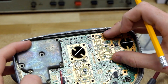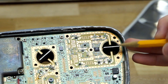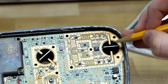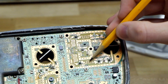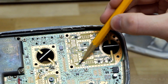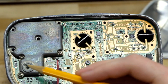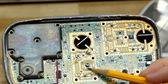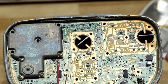This feed horn section and this one are symmetrical, so I'll show you this one for demonstration purposes. It's circularly polarized, so these two antennas — one is for the right hand and one is for the left hand — and there's a stair-step septum in the middle that splits the incoming wave. It's basically a series of low noise amplifiers, and then there are what I believe are called edge-coupled bandpass filters right here, and some more amplification. There's a dielectric resonant oscillator — actually two of them on this one — with a set screw to adjust it. That comes out of a BJT, which goes to a pretty simple diode mixer array. I can't really tell the exact topology because it's all surface mount stuff.